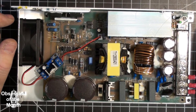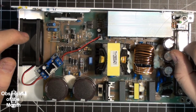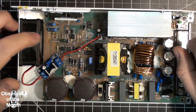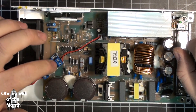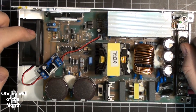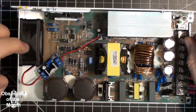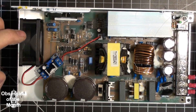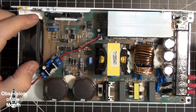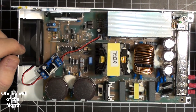The first thing I did before I turned it on was open it up and make sure that no components were touching, that all the capacitors were standing up, and the transistors and any resistors were spaced so that airflow would cool them — just making sure there were no short circuits of any kind. I have opened up this stuff before and found things touching that shouldn't be.